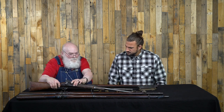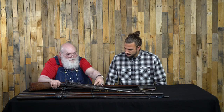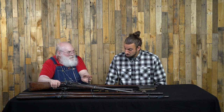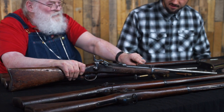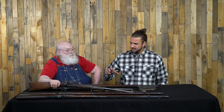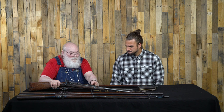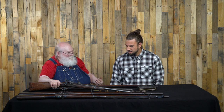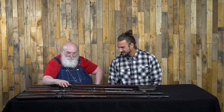Later on they came out with the Buffington sight. This screw would turn and the base would pivot back and forth so you could get your windage in there, and then your elevation you'd raise this up or down, or use the rear sight as it was folded down. So this is when we start to see really early adjustable sights. It made shooting these a lot better for distance. You look at the peepholes on them — they're fairly small — the beginning of peephole sights that were used in military rifles after that.